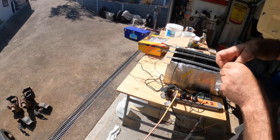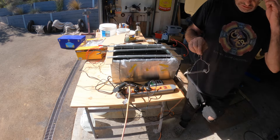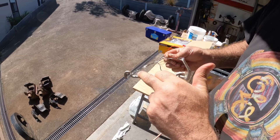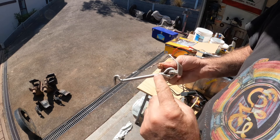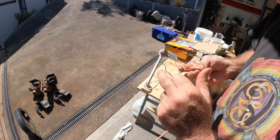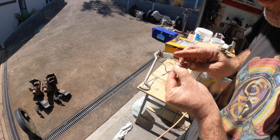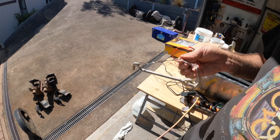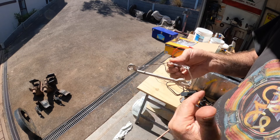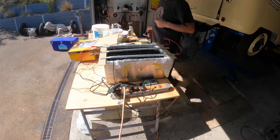Let's check the other piece. I've got a feeling it wasn't prepared properly, because if you look at the copper, the copper is glistening, and the part is a little bit on the cloudy side — though that side is better. We might have needed a few more amps. That looks like it was trying to plate, but this is the first plating effort. It looks amazing — really good. You can buff this up on the buffer as well once it's done. We've got one more piece to put in, which is our visor part.